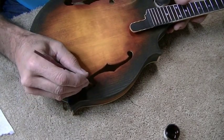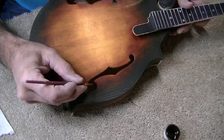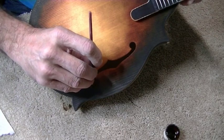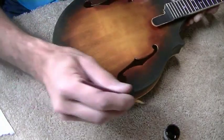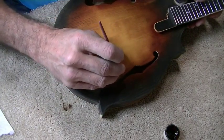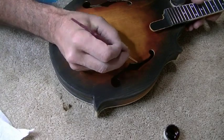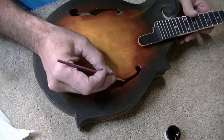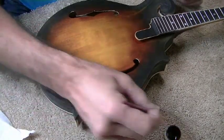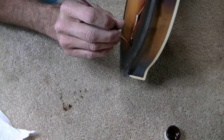I've just started darkening up the edges and the airbrushing will blend a lot more of this. I'm going to use dark brown dye to paint the insides of the F-holes because if I use black it might get on the lighter areas and would be really hard to blend out — the dark brown will be easier to blend and it's kind of halfway between the black and lighter colors anyway. I apologize for not turning the camera on; I got busy and forgot.